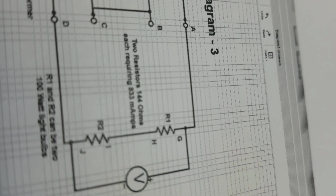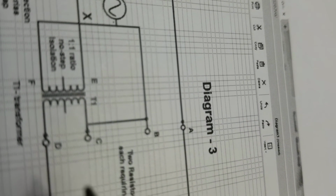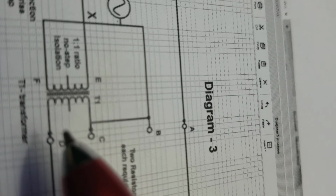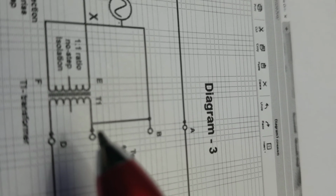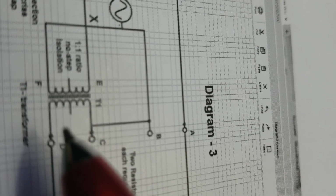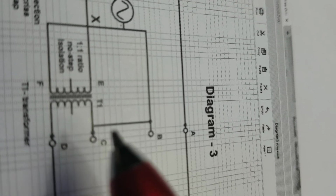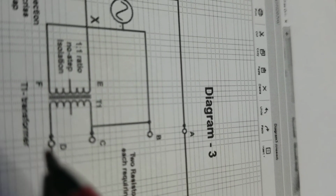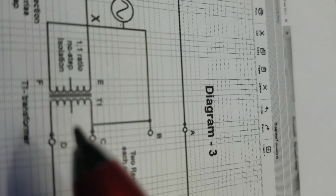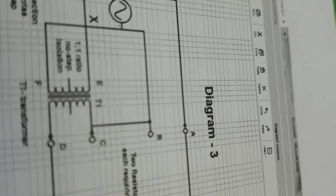Now, I think that's all I had to say about this, to explain it all. But this series connection here is what is the secret here. Well, I want to note, if you wire up the secondary coils wrong with point B, you're going to get 0 volts. And if you do it right, you're going to get 240 volts between A and D. So you don't have to worry about wiring it up wrong, because it's either constructive interference or destructive interference. So there's no worry that you're going to short something out.